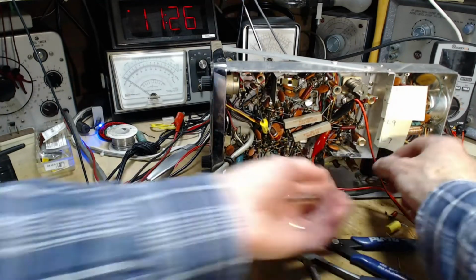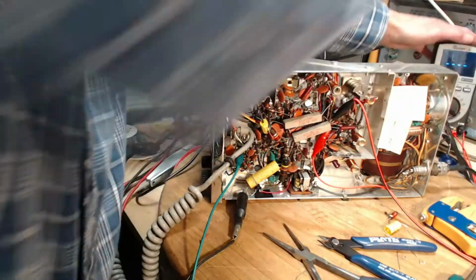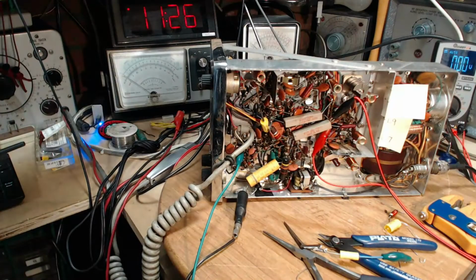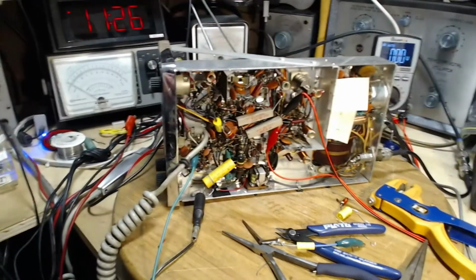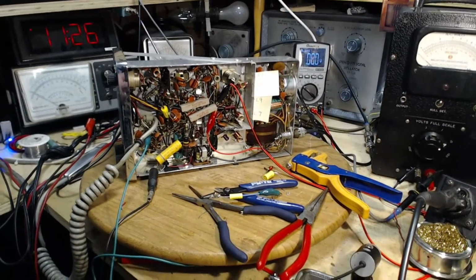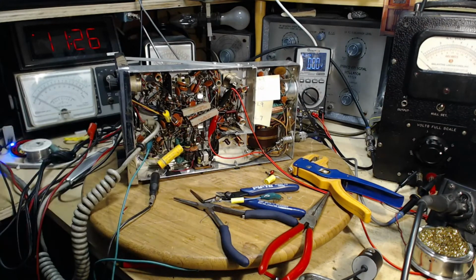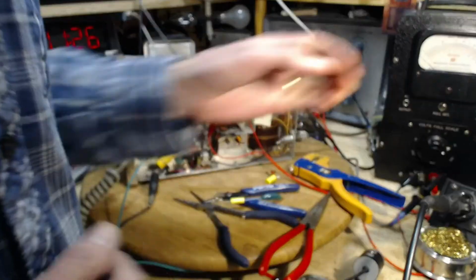Got this connected. We still got this plate current, which I think is pretty important to keep an eye on. We're going to transmit, and we're hooked up to the outdoor antenna. No, we're hooked up to an antenna lead to nowhere right now. It's disconnected at the other end. What is going on here that we would need to transmit? Okay, so we could transmit for just a moment just to make the relay operate, or I put a dummy load on it. That's even smarter. That would be a smart move.